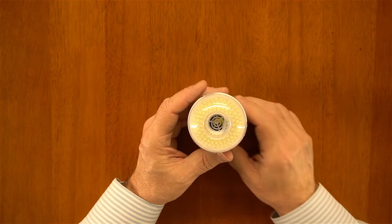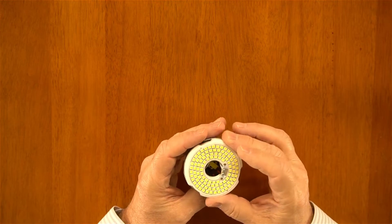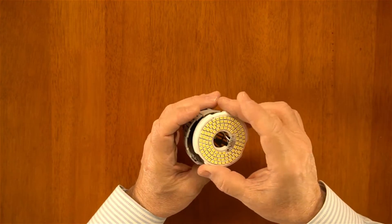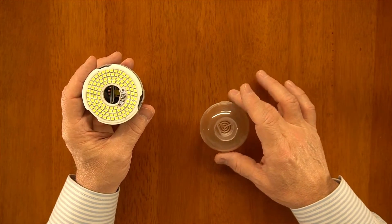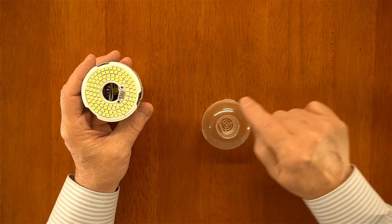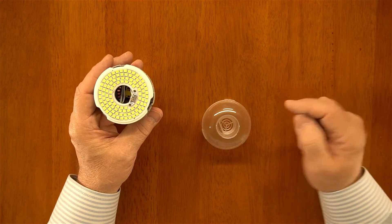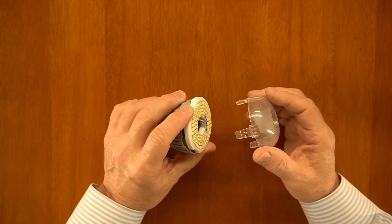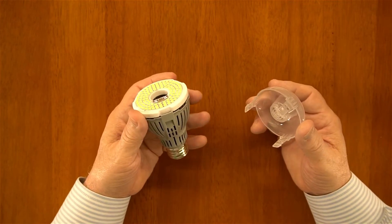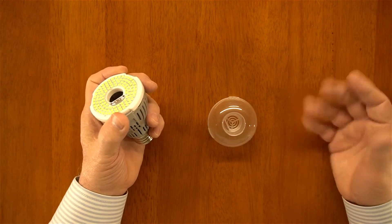I can't resist taking stuff apart, so I actually took one of the bulbs apart — here's what it looks like. Here's the ceramic base, you can see it's pure ceramic. Those are all the LEDs that make up the bulb, and there's the electronics inside. Let me show you that lens: if it were clear, you could see right through it. Watch what happens when I put it down on the table — see how it turns yellow? The light's hitting the table and reflecting that color through the lens evenly. A brilliant design element you might miss if you hadn't taken the time to tear it apart. Pretty much every aspect of this bulb was well thought out and well constructed. And they give you a five-year warranty on them, which is unheard of in this industry — most bulbs you buy get a 90-day warranty or maybe six months.